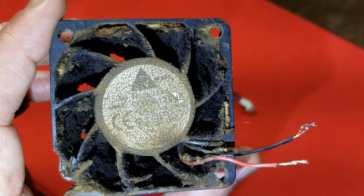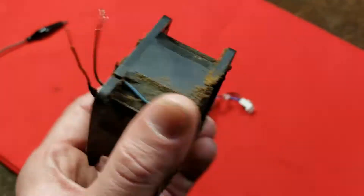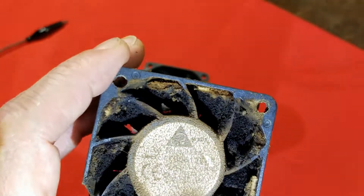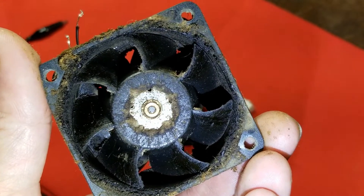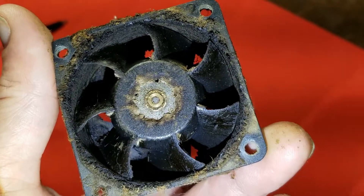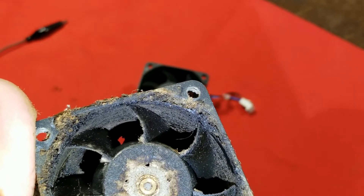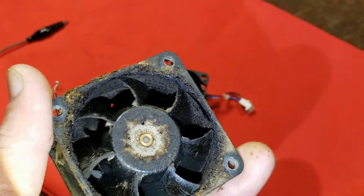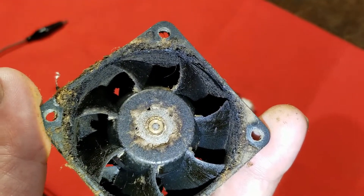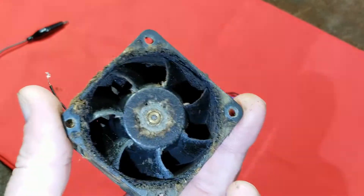In this food service environment we can see this fan is almost completely sealed — so clogged it can barely move any air. Looking inside, all the dust has built up so much on those exit vanes that the backside of the fan rotor started hitting the top of the dust buildup and just continued grinding for weeks. We can see the buildup on the wall and the blades actually shaved it down — that's a pretty incredible testament to the durability of this little fan.